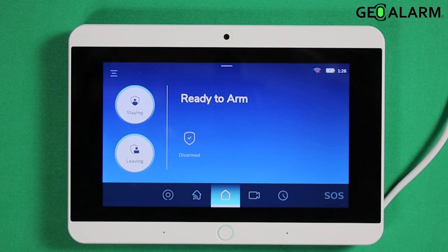smart arming is. Smart arming is the opposite of unvacated premises. So say for instance, you arm your system in stay mode, and your system recognizes no one is moving in front of motion detectors. Well, your system can sense that as maybe you accidentally set it up as stay mode. And stay mode means no motions are enabled or anything like that. What it can do is automatically convert itself to arm away, where all of your motions become active. This is a useful feature if you forget sometimes, but otherwise you can just leave it off.